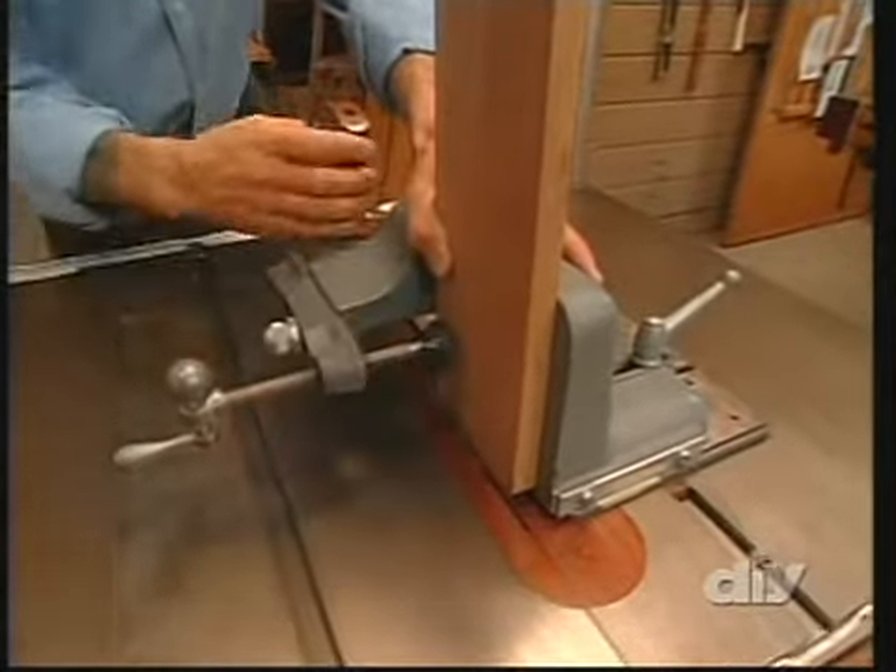We're putting on the hand hammered copper handle onto our arts and crafts style nightstand. To clarify about the fumed finish: don't make the mistake of using household ammonia — it's not going to work. What you want is 26% industrial strength aqua ammonia, available from a chemical supply house. That will give you this authentic arts and crafts style fumed finish. The quarter sawn oak displays its fine grain throughout the piece, the exposed tenons on the front and back legs add to the classic design, and the silvery tone from the fumed ammonia finish completes a look rich in the traditions of the arts and crafts style.